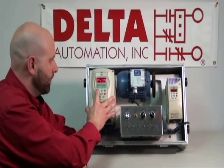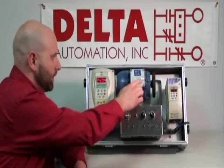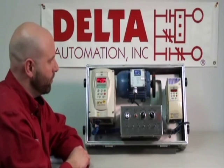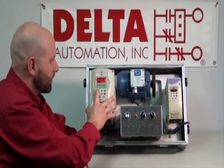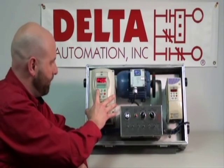Arrow up. Motor rated power is one-third horsepower — 0.33. It probably already knew that based on our amperage, but yes, that's correct. We'll hit up. Is this a self-ventilating type motor? Yes, this is. So this particular application, that's correct. We'll hit up.